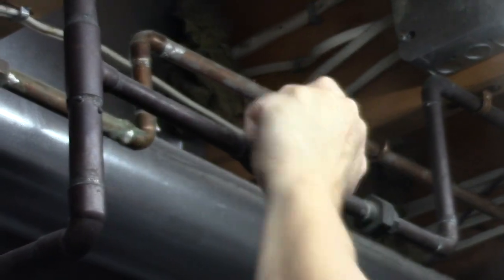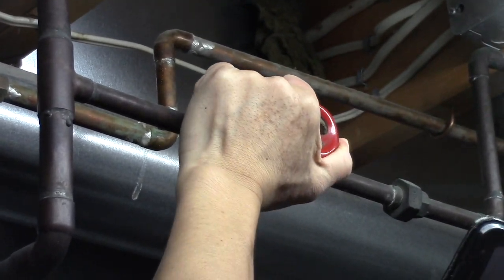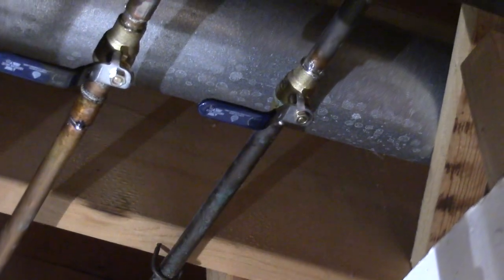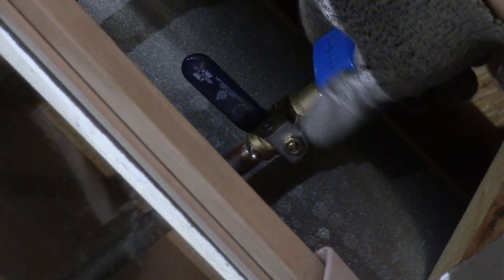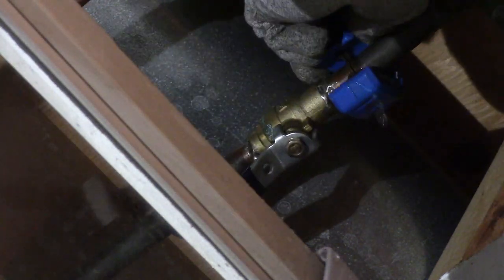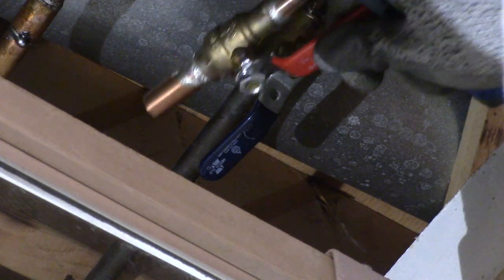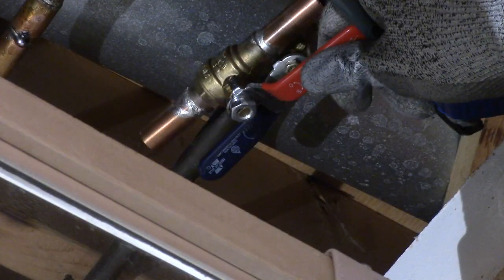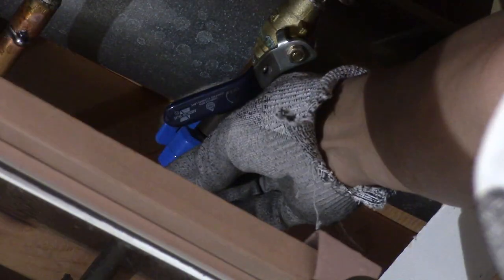Then my brother Larney will shut off the water valve. I'm marking the spots where I'm going to cut the pipes and proceed to cut off the old stop valve. Just make sure you have enough clearance to put the new stop valve with the shark bites. Let the remaining water drain off. Then I do a quick measurement to see where I'm going to cut the other pipe — double check your clearance because you'll have the shark bites there too. Then proceed to cut off the other side.